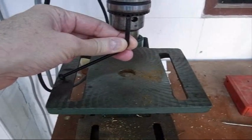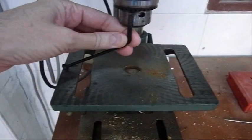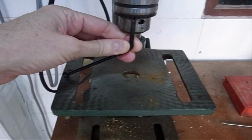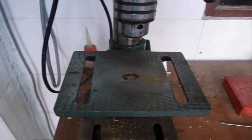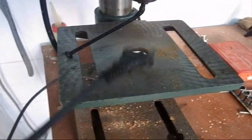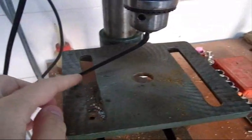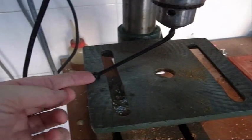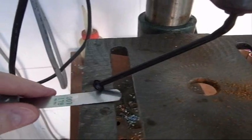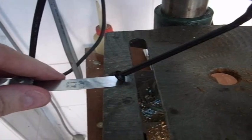That's all there is to that. When it's chucked in there, it's touching the table all the way around. With your drill press unplugged — make sure it's unplugged — you put this wire in here, fasten the chuck firmly, then you simply measure using your feeler gauge the distance in there.